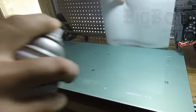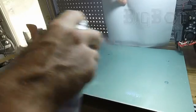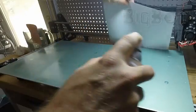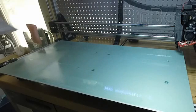After five or so coats of enamel, a reasonably thick layer will develop that might start making your parts a bit rough on that first layer. Also, try not to cover critical printer parts with clear enamel — I haven't found an issue with this, but it can't be good. If your printer nozzle is on and you spray it with highly flammable aerosol, that's not good either. Once the enamel is dry in ten minutes or so, you're ready to print.